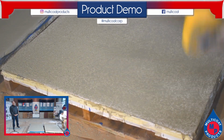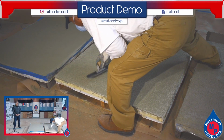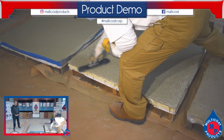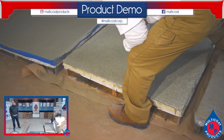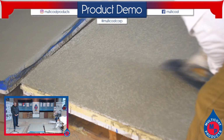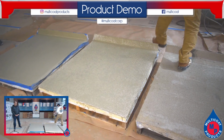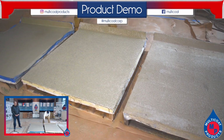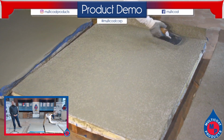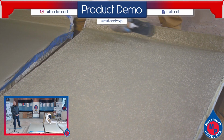And if you use our vapor shield on a concrete deck, it'll also block any efflorescence issues that you could have. Typically, vapor shield, anytime you're doing any project, our product or anybody else's, I'd recommend it. It's a potassium-based product, and your cost is somewhere probably between 20 to 25 cents a foot. It's cheap insurance for you anytime you're doing any kind of overlay over concrete, above grade or on grade.